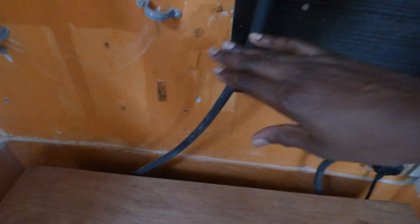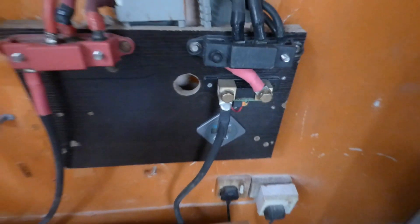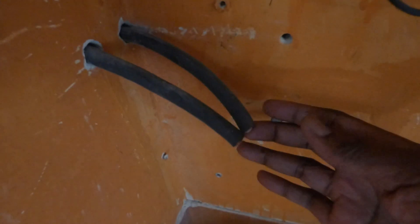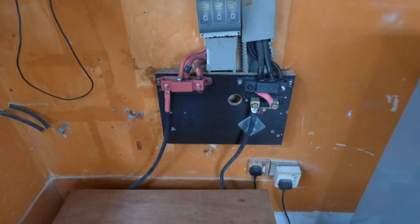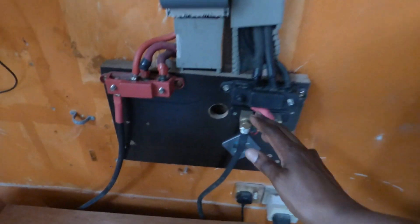What I discovered was our cabling — we had different sizes. This was a 75mm cable and this was like a 25mm, and the interconnect was a 20mm, much thinner than what we have from the charge controllers. So what did I do? I cut new cables, took them from here, made them the same length using the exact same gauge, and I replaced the old ones. Now our cables are equal length and the interconnect is the same size, so everything going from the battery to the bus bar is exactly the same size.